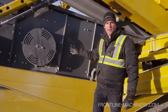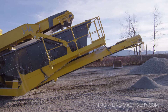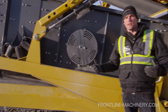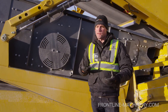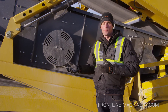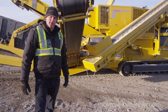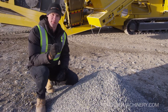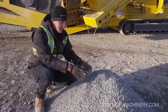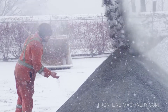Right now I'm standing in front of the triple deck screen box. It's a 5x12 triple deck and we're in the maintenance position — the screen deck drops down and the under-screen conveyor also drops down, giving us incredible access underneath the screen and on top. The screens are all end-tensioned, which means per deck we can change a deck of screens in and out in about 30 minutes — very easy to access and change. With the modern hydrocone technology Keystrack uses, the product is very cubical and suitable for use in asphalt, aggregate, and concrete applications. With this triple deck, we're producing three different finished fractions of product with the one machine.